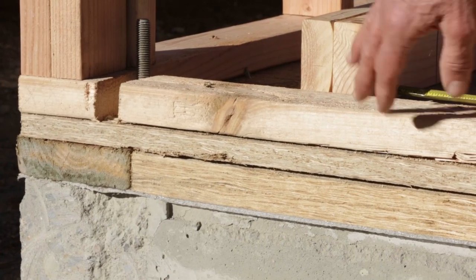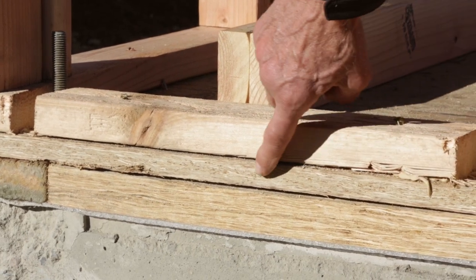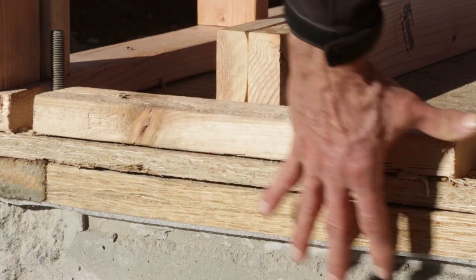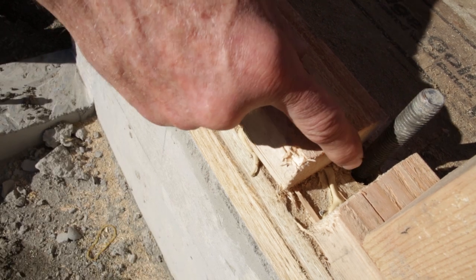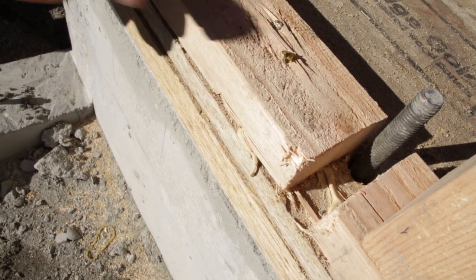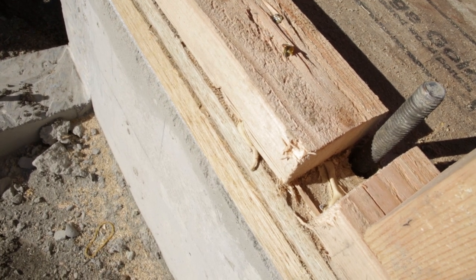When they stood the walls up, this is the bottom plate of the wall — you can see glue there — they've actually glued that wall down. That should seal everything up here. And as I pointed out, these hold-downs which penetrate the floor and the plates sometimes leak, and we'll seal those up from the inside with spray foam as part of our interior sealing process.